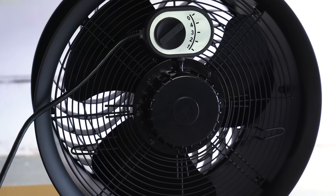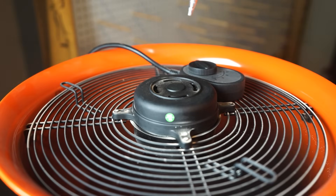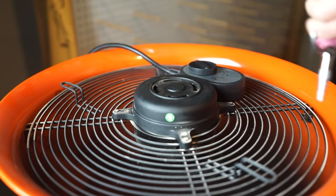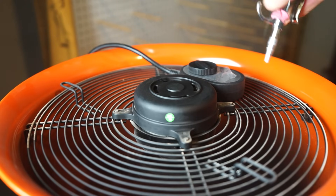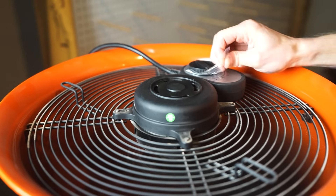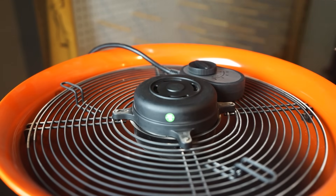We won't be doing that in the real world — the fan enclosure helps keep us safe. In fact, one of the only mishaps I had with my original filtration unit is that a set screw got loose and the fan blades just fell off the motor one day. If there wasn't a cage there to stop the blades, they would have rocketed into the filter box and potentially torn the whole thing to pieces. A boost in air flow is not worth that risk.